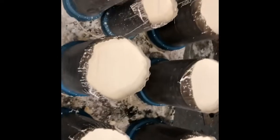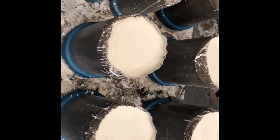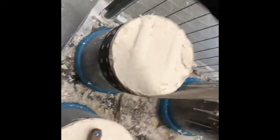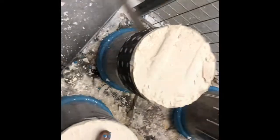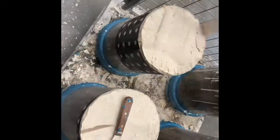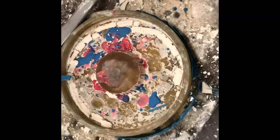After about 40 minutes of hard graft mixing, the wax castings are now ready to be put inside the oven. I have to start by taking all of that tape off — and again, yes, that is tedious. I also need to break off the bases from the flasks — and I probably shouldn't have done this one-handed, as you can see that wasn't supposed to happen. So I've broken the rubber base off from the flask, and now all I need to do is pick them up and put them inside the oven.